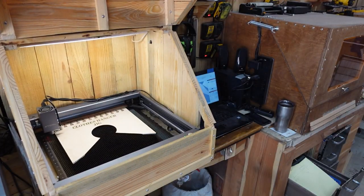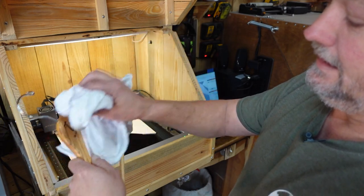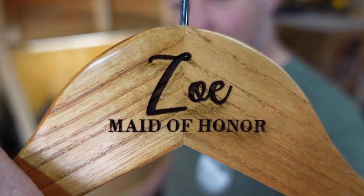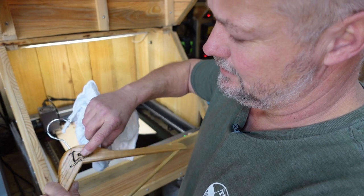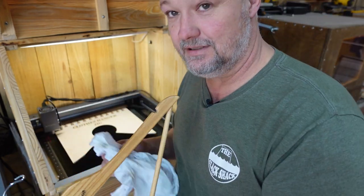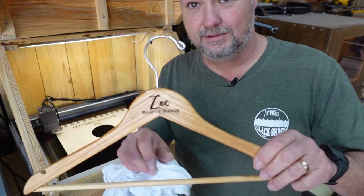I'm going to step over here, hit it with a little bit of my cleaner — just spray it and wipe it off with a rag, and voila, it gets it off. You can't see the engraved lines with 254 LPI on wood — it makes really clean edges with no lines, no constant back and forth. I did just clean my machine — cleaned the lens, cleaned all the rails before I started this job because it was a little dusty. But that's three down.